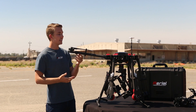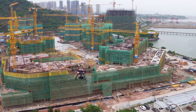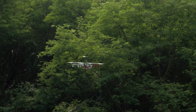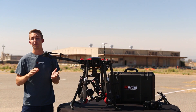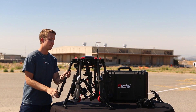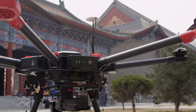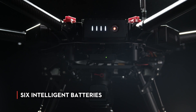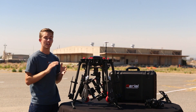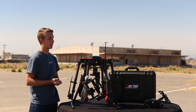First thing I'll point out is this is a six-rotor setup, so you actually get the redundancy and safety of a six-rotor system. That essentially means if you were to lose a prop, a motor, or an ESC during flight, the copter would still be able to fly on five of the six motors. They've used the same thinking of redundancy with the batteries — the Matrice 600 runs on six separate batteries, so if one turns out to be unhealthy during flight, it will still fly on the remaining batteries.